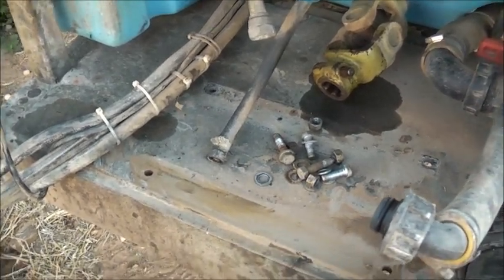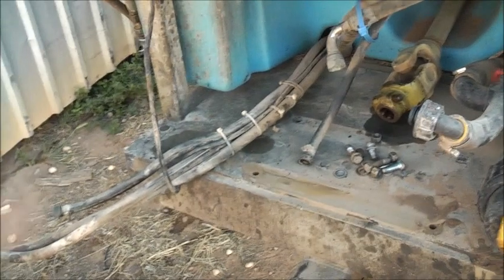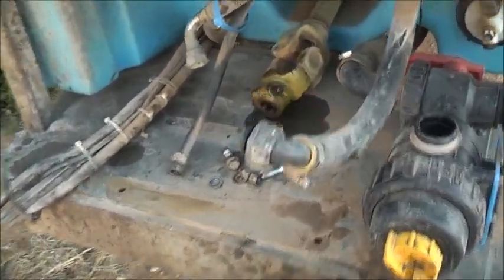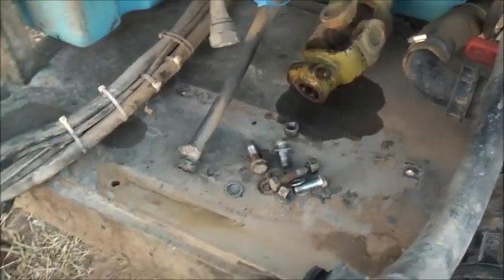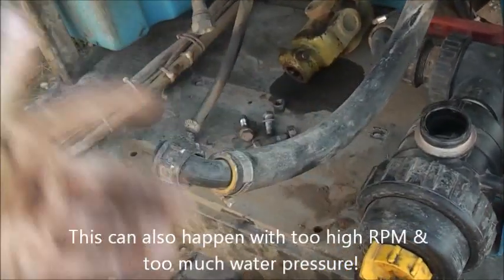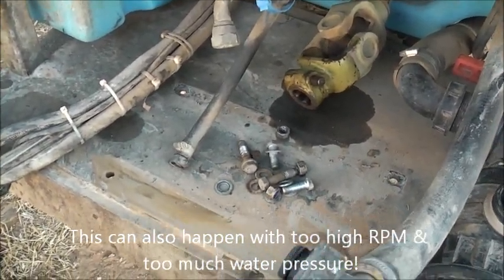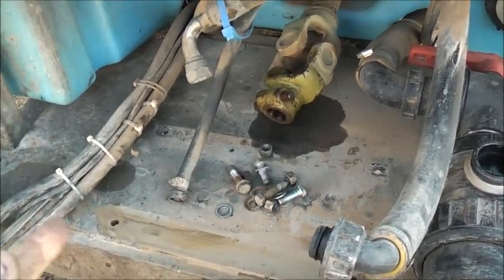Basically a reciprocating mechanism, piston cylinders, failed pretty catastrophically. There was one case where we had to make one good pump out of two, because the crankshaft had smashed off all the connecting rods and chewed up the crankshaft. The only salvageable part was the alloy body of the pump — the rest was pretty much ruined. The heads were OK, so we just swapped the internal crankshaft and pistons from another similar pump into that one to repair it.